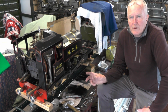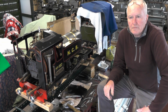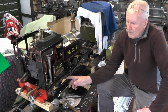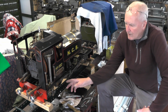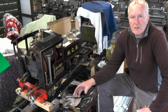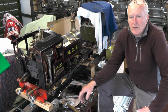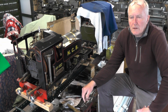I think on my next video, I'll fire the loco up, and I'm going to attempt to try that gas burner that a friend let me have to try, which he's never tried. I've only just got round to being able to try that. I've also never worked on my injector properly since I've had it. It works at about 50%, so the same friend has loaned me one of his injectors to try, to see if it makes any difference. Then I'll know if it's my injector or not, that's the problem. I'll do that in the next video, that sweet pea gas burner. I will have to fire it up on butane though, as I've got no propane in a bottle that's suitable. So I'll do that perhaps next.